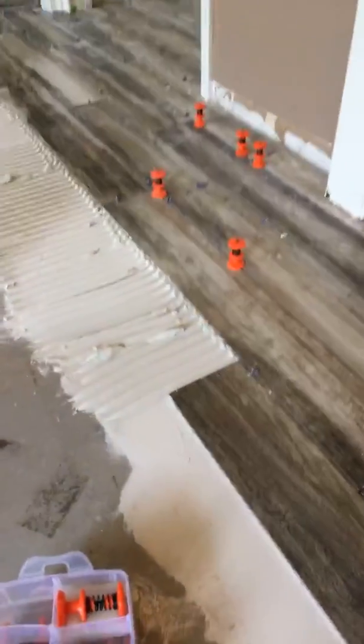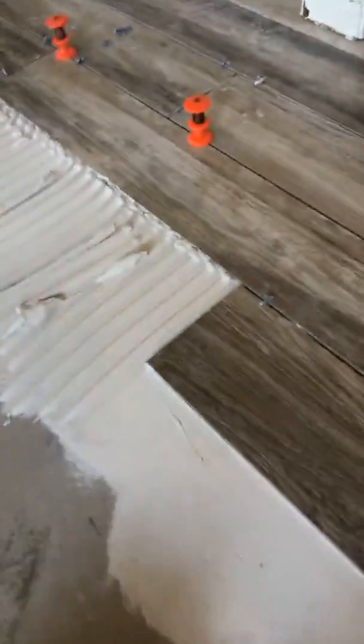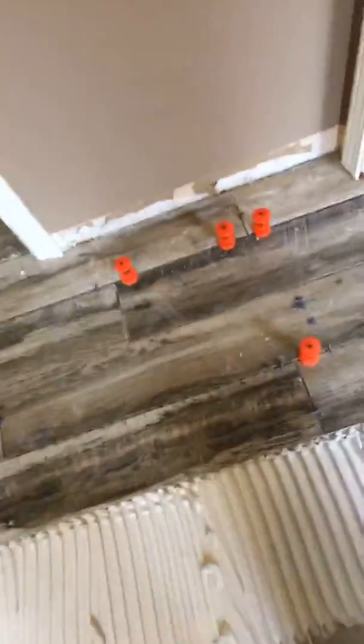So I'll show you the floor. We're doing a plank floor here, and it is pretty flat. The tile is flat, the floor is very flat. This is not a substitute for floor flatness. This is just a lippage tuning system, or a mono calibrator, that will dial in some of the differences here. This section of the tile coming into this room has a bit of a slope, and we have fixed it to about 1/4 of an inch, so we are still within tolerance of the floor flatness.